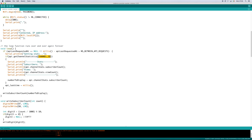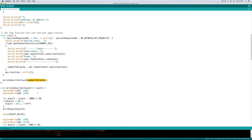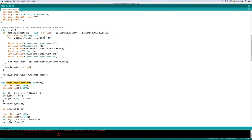API.getChannelStatistics gets the stats for a channel by ID. We output some of the response data to the serial output and then grab the subscriber count to display on the LED displays, and call writeSubscriberCount with this value. WriteSubscriberCount takes a count as an argument.